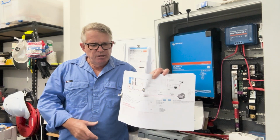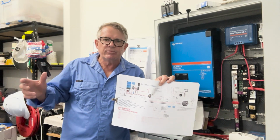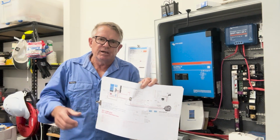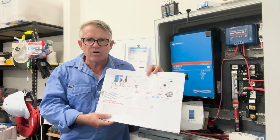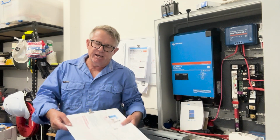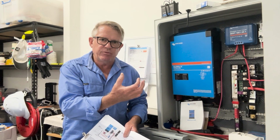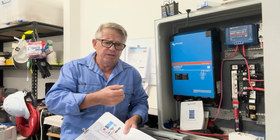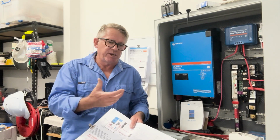So the idea of this video is just to give you an overview of what I'm going to be doing in the future. I'm going to be looking at how I've come up with all of these circuits, why I'm using certain devices, why I'm using certain cable sizes, wire sizes. A cable is typically a big cable with multiple conductors in it. There might be three or four wires contained within a double insulated PVC jacketed cable or something like that.